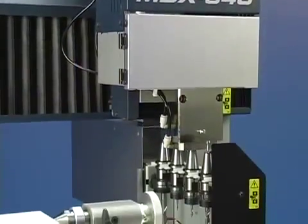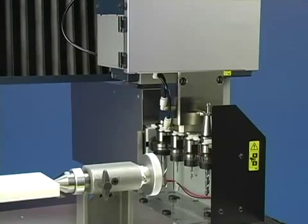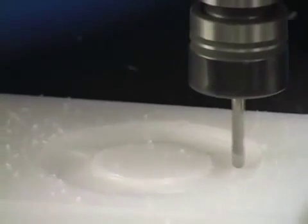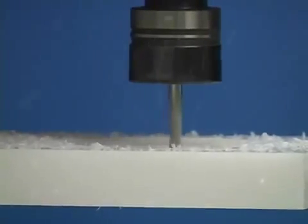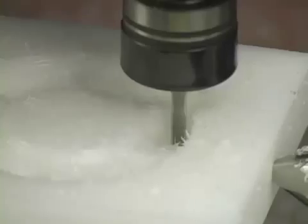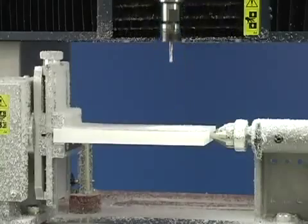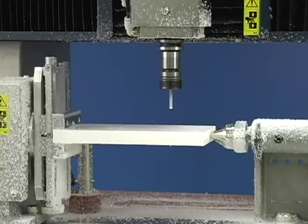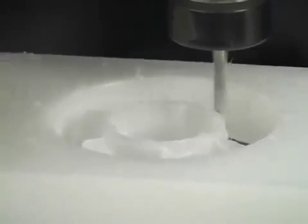Press Start Cutting to begin milling. From here, the Roland MDX-540 takes over and will automatically select tools as needed. The process begins with a rough pass to remove large amounts of material, followed by additional passes to perform finer milling and surface finishing. The MDX will also automatically rotate the object as required. The time required to mill the model will depend on the size, complexity, and material used.